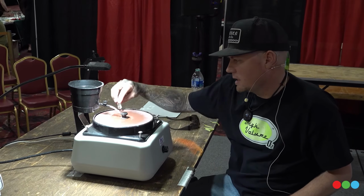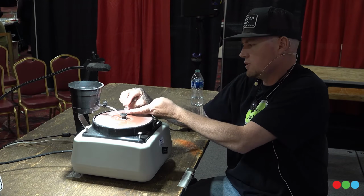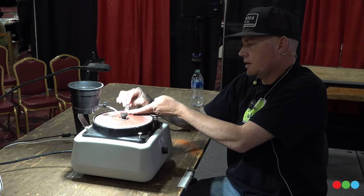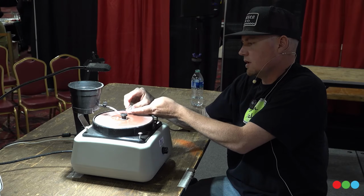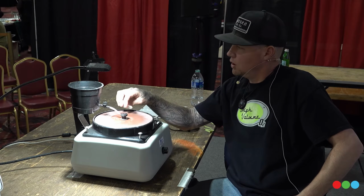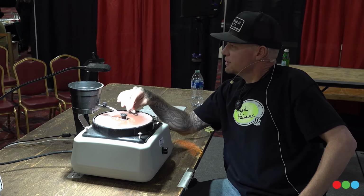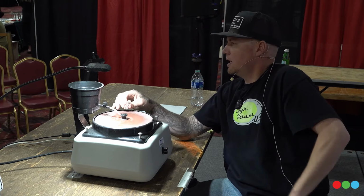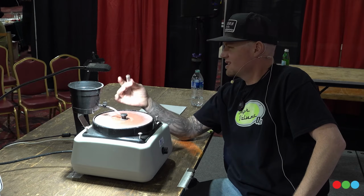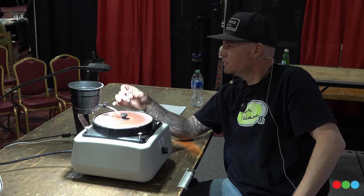And depending on the angle that you hold it on your wheel, it's going to give you different angles on the ends of the crystal as well. So just be sure not to hold it there for too long, depending on what grit you're using. If you hold it there too long, you're going to wear down one side a lot faster than it should, and it's just going to end up uneven, and you're going to end up chasing that evenness the whole time.